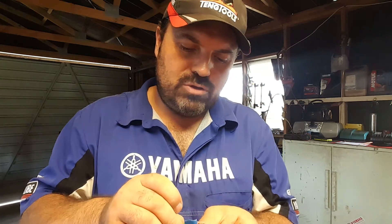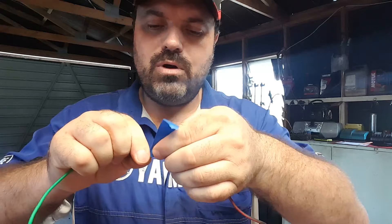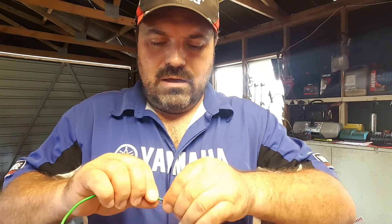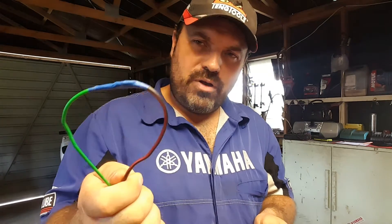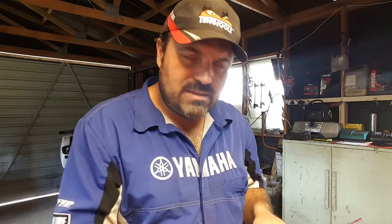A couple of inches — two and a half inches will do. Drop the tape on first over the insulation to start with, then work your way down. There we go — the last bit I just break off because it's usually lost most of its stickiness. The way that's done, it helps hold the joint together and also insulates it at the same time. I don't endorse twisted wires but I know it happens. It's fine as a temporary fix, but long term it's going to fail — you're much better off soldering it. That's the tape — versatile, great, and it can also be used for holding batches of wires together.